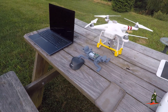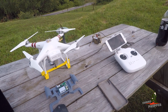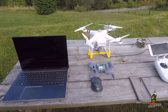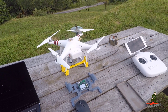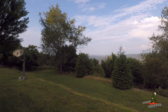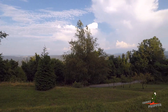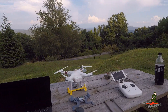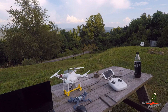The test today is to take the drone up with this AREDN node tethered to it, with the node activated. I have three or four nodes around the retreat here. I'll log in to the laptop and see if I can connect to that node. The concept is, during an emergency, if I don't have line of sight with anybody else here in the valley, I could put the drone up for a 20-minute period — FAA regulations allow up to 400 feet above ground level — I could easily put this drone up 250 feet with that AREDN node, park it there for 20 minutes, and that would provide a window for other stations in the area to send and receive emergency communications.